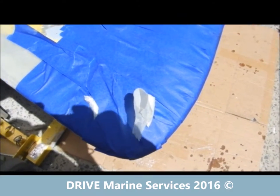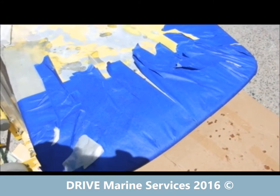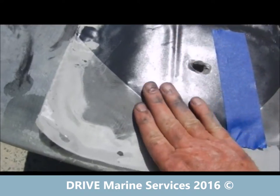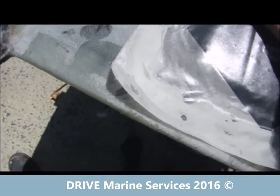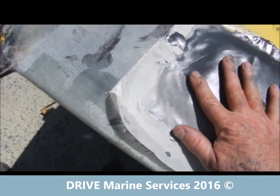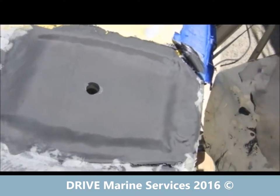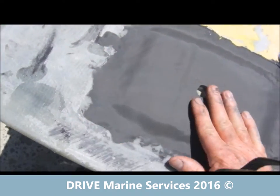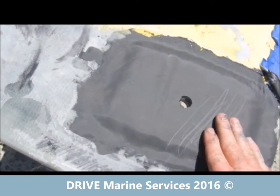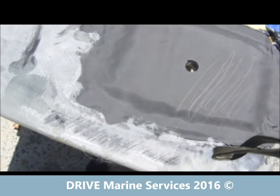Down this end we've used quite a lot of masking tape to hold the peel ply and the glass on — don't be frightened of putting masking tape over the top of the peel ply, it works quite well. We put some graphite into our Boatcoat this morning and built up a layer on this bearing surface — it needs to be level with our rudder. It's dry sitting out in the sun so the epoxy cooks off fairly fast plus it generates its own heat. I've already started to peel it off — see how it comes away and leaves a nice smooth finish. If it's fairly level we won't even need to do any sanding — we could epoxy straight over the top. Look how smooth and even it is — that's what peel ply can do for you if you use it right.